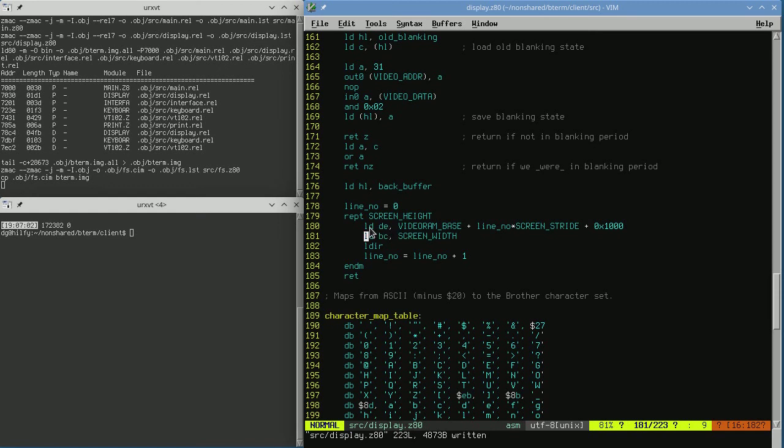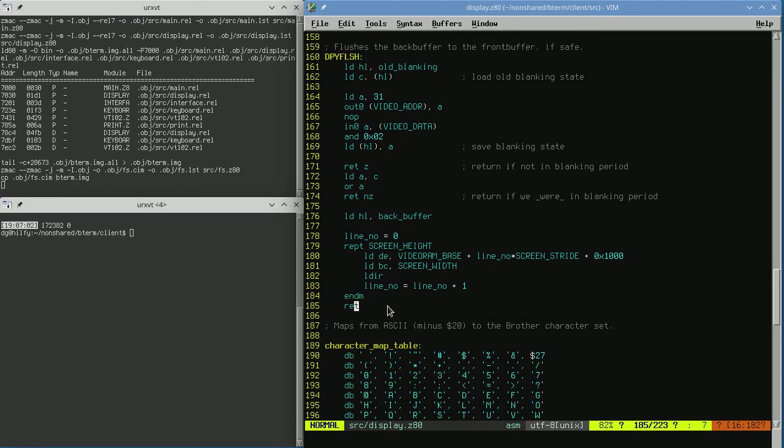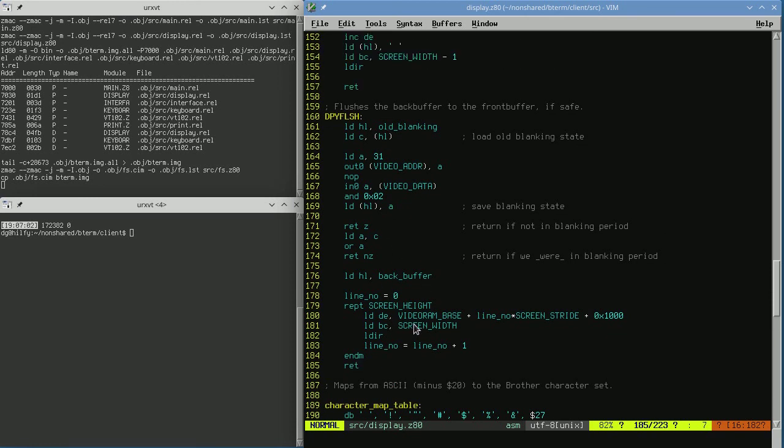And this should give us, well, this DE line is 3 bytes. Our previous code where we called add AHL was 5 bytes, 2 to load A with the value to increment, 3 to call the subroutine, and a reasonable number of cycles because we have to do the call and the return, which involves stack operations. Stack operations are slow. So I think this, assuming I haven't made any stupid mistakes, should be a big improvement. So I am just going to try it and see what happens.